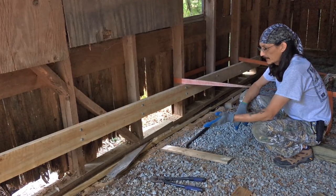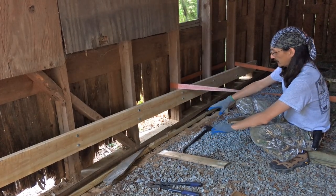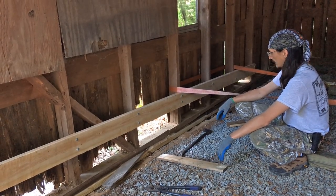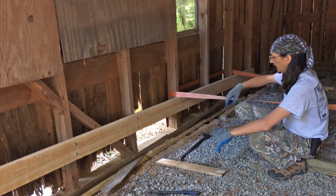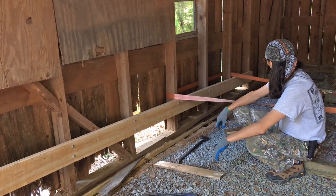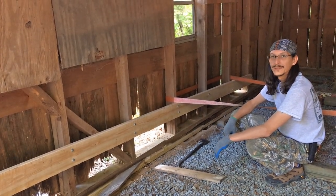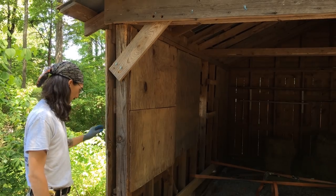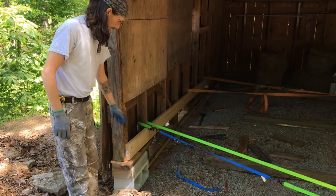Okay, so this whole thing is like a gap. So I filled it all in with 2x4 chunks. Everything's pressure treated, so I think I've got it all wedged and shimmed. Drove nails down into the boards. I hammered the nails into the wall shoe. Also, I bolted this support back on, hacked that off, wedged and shimmed it onto a block.